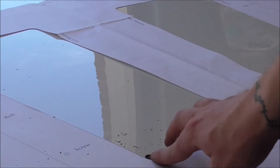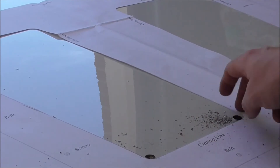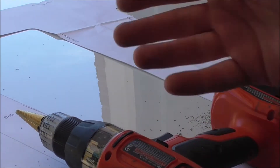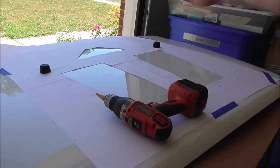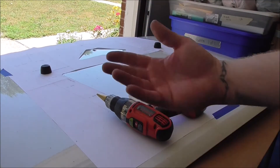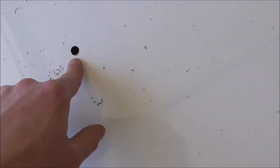I ended up going about seven-sixteenths. I do have a dremel as well so I'll clean up the corners the best I can — all you've got to do is cut it straight and I can clean it up with the dremel. On this one there was a little bit of material in the center. I'm going to finish this off camera, sped up a bit, then mark my lines and show some of the cutting action. After drilling four holes up here — uneven, but it is what it is — I drilled another one but it looks like I was going into the support, so I said forget it. I traced everything out with a pencil and I'm just going to cut it with the grinder, then go back with the dremel to clean up the corners.